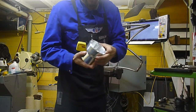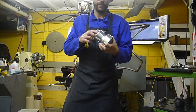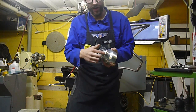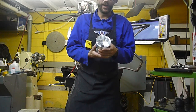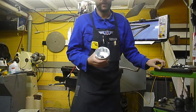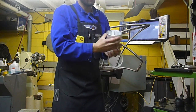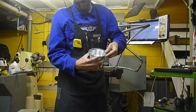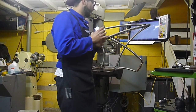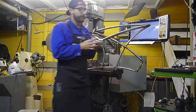Let me show you some of the stuff I've been building using HSM and Fusion 360 CAM. One of the cool parts is the front hub. I did all the turning on a Haas — my buddy Liam helped me out a while back. Did the HSMworks lathe work. This is a wild cut down into the pocket. Then I came back through, designed a bolt pattern around it, and radially machined it using a ball end mill, basically scooping out the whole inside of it. Then made it so I could mount a disc brake rotor on it. This is the front end — this is 7075, machines super well. This will be the front hub of this concept bike.